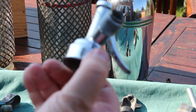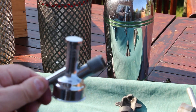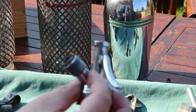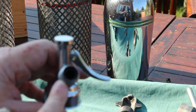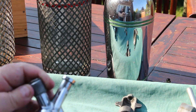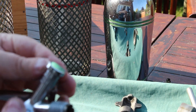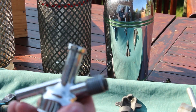This is what you end up with — something that looks like this. This is an original Type D soda siphon head, London pattern, which just means it was made in London. It's essentially the same as the American ones, which are usually called New York pattern — some minor differences in design of the internal components, but they are essentially interchangeable, with slight differences in seal sizes. What we've replaced is the bulb neck seal, the pin's been sharpened, the seal screw has been reconditioned, all the seals on the piston piece have been replaced and reassembled, the spring compressed and capped, then carefully crimped into place with a special tool.